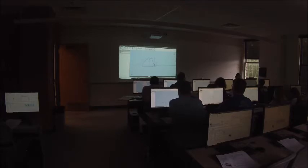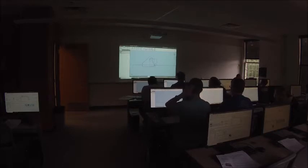So first off, we've got this arc, and these lines attached to this arc. We know that we want those to be tangent, because that's what's going to look best. So let's get a tangent constraint going. Let's attach a tangent from this line to the arc and the other angled line to the arc. You just click on one, then the other, then you go to the other side and click on one, then the other. Stuff is going to move around, but don't worry about it just yet. Press escape once you're done with that.